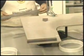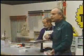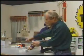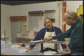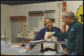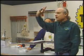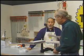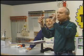What I do is I cut these on a chop saw to length. Because my deck is oversized, I'll cut them right to length where I want them because I know they're going to be an 1/8 of an inch back. These are all 4 pieces. This is your radius cut out here for the radius. And then what I put is a little triangle gusset block in the inside corner, which is just a section of this, put on a chop saw and cut at a 45 on both sides.